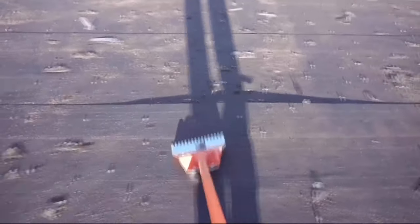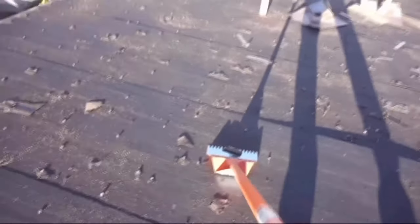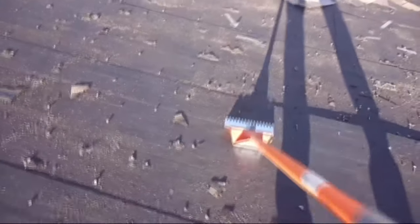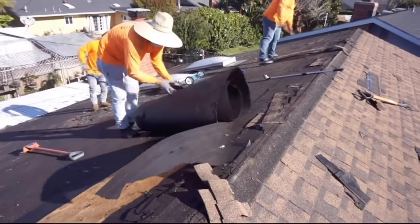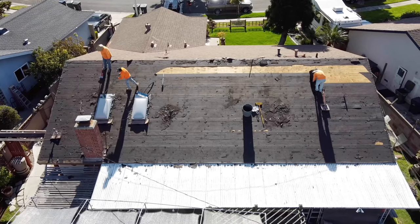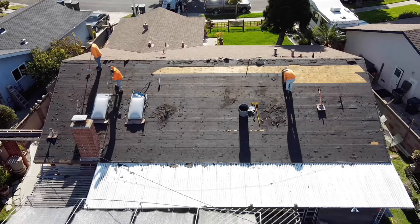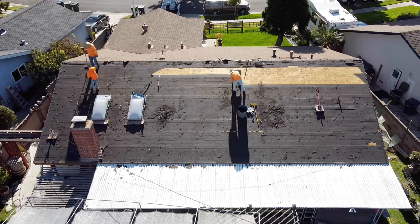Once all the shingles are removed, we take our duck's foot and rip up all the nails from the paper. This way we can get behind the paper on one end and start rolling it. When we roll it, we do it at a little bit of an angle so we can collect all the debris and shingle grit in it. One thing I like to constantly do is hit the roof with a magnet, because there are just so many nails — typically we do four nails per shingle here in California, so times that by a couple thousand and it really adds up.